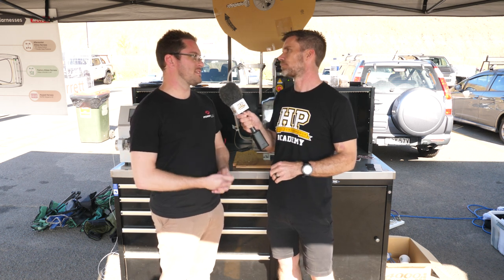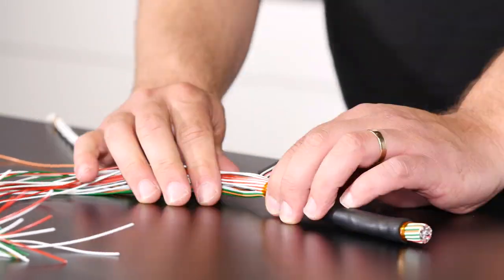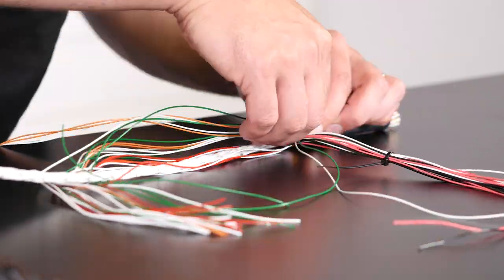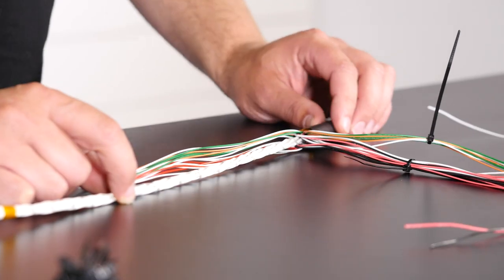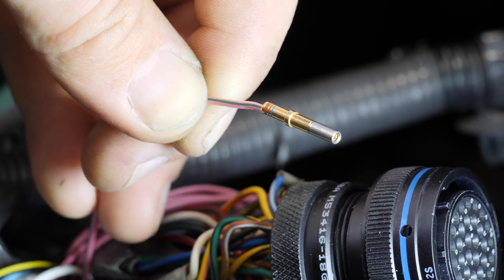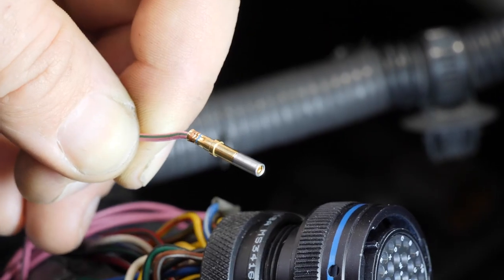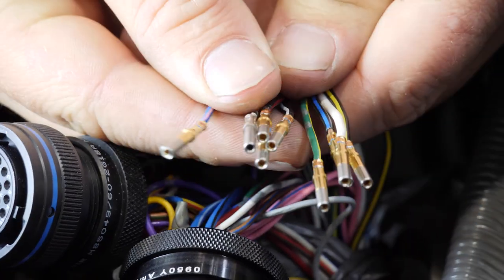When you start to scale, any modern motor vehicle typically has around 180 to 190 pins on the ECU, so that's quite a lot of hand soldering and crimping for an individual to do. Then comes the potential for errors creeping in — maybe the crimp isn't quite right. We always talk about the benefits of crimping, but when we say the crimp is superior, we are expecting a quality crimp using the right materials and the right crimp tools.